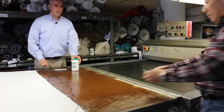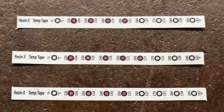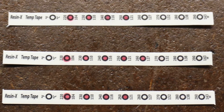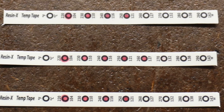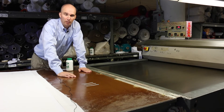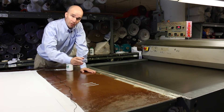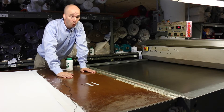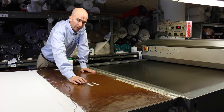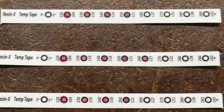We'll take a look at these machines. The strips came through and the temperature that it indicated was actually 250 degrees — about 20 degrees higher than what the thermostat is saying. That's not uncommon at all. As long as you know where your machine is, you can either adjust your thermostats to match what we call the glue line temperature, or just know that if you set it to a given value, it's going to be a little bit higher. We also saw that in the center of the machine it was about 10 degrees warmer than on the edge, which is fairly common.